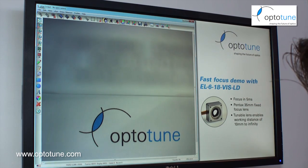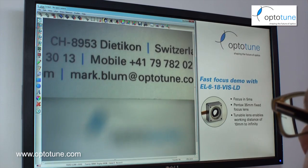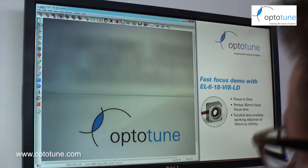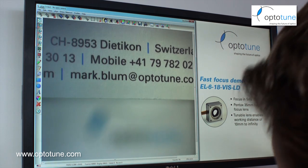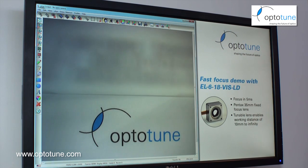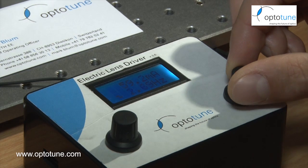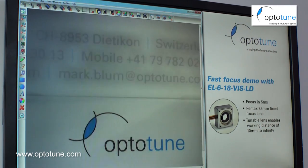Right now the camera is focused on the bottom level, and with this driver I can increase the current to focus on the top level. We end up with something like 60 milliamps, and when I switch between the two levels you can see the image stays in focus — showing that we have no hysteresis when switching between different levels of current. With this demo I can also apply a step function, so for example 3 Hertz gives you an idea of the dynamics of the system.